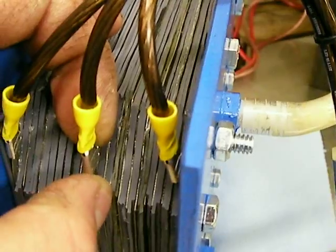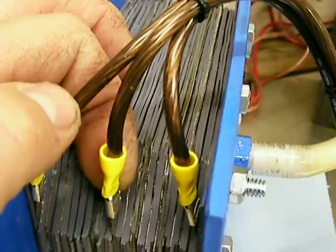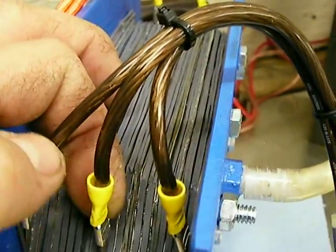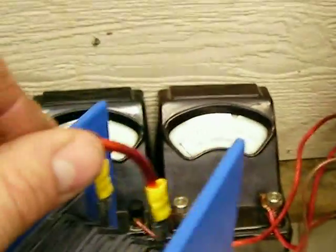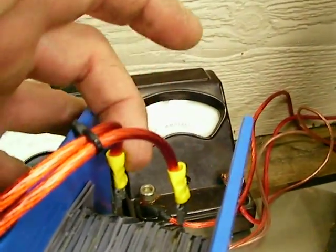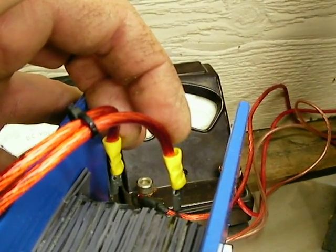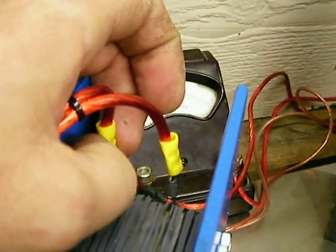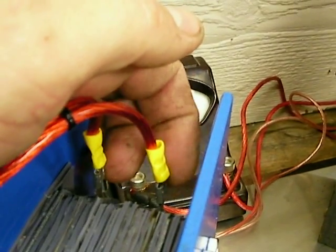My connections are basically what everybody else is doing. I was soldering them on, but since I'm only going to run this cell at 35 to 40 amps, the amperage isn't going to be that great at basically 12.5 volts. Each positive is split, so I'm only going to get 15 amps off each one of these wires. I'm going to try it without soldering and see if these connections get hot. I'll keep an eye on it and check for carbon arcing.